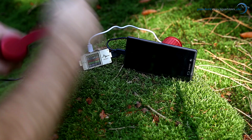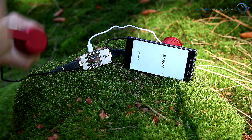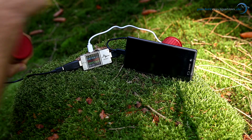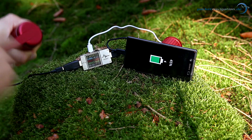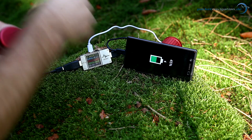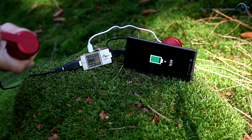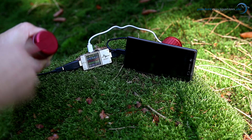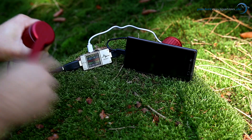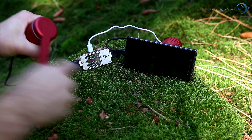Let's try it. Instantly you see it goes up to 600 milliamperes. It fluctuates at the beginning as the smartphone is trying to figure out how much energy it can get away with absorbing. Now the amount being absorbed is at about 1 ampere. How close you are to the 1 ampere mark depends upon how fast you turn the crank. At about 4.4 volts, I'd say you're at a charge rate of 4 to 5 watts, which is pretty decent. There's more resistance now, but I'd say one could turn the crank at this speed for 10 to 15 minutes.